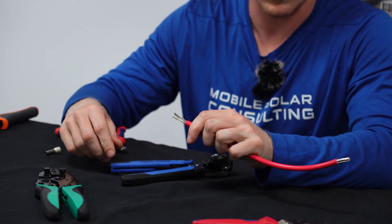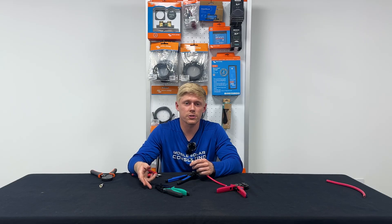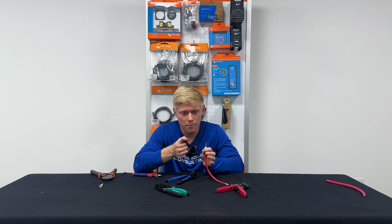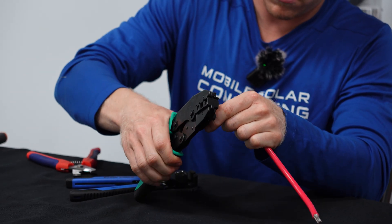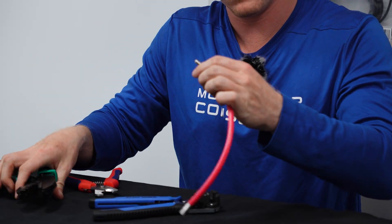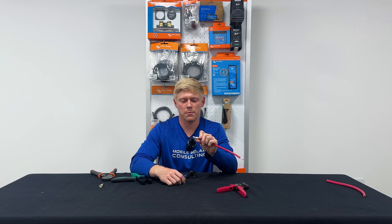If you're working on an Orion TR Smart, or maybe a SmartSolar MPPT, and you need a square crimped ferrule — some of these pieces of equipment like the Orion and certain charge controllers will only fit a maximum of 6 gauge wire. And once you put a ferrule on it, it's a little larger, so it barely fits and you want to match the square shape of the terminal. So you can use this — this is the Proskit CP-336F. Slip the ferrule in, crimp it down, flip it over and crimp the other side as well. Now we've got a decently square shaped ferrule. If it's not perfectly square, you can always take some needle nose pliers and mangle it into the right shape, but usually this gets the job done.